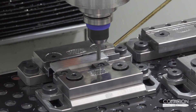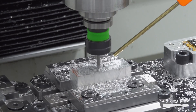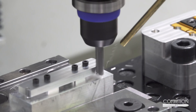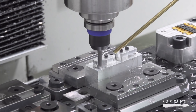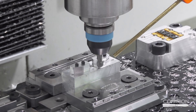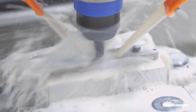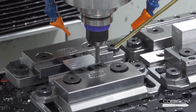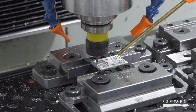I also made handle spacers and buttons again, pretty much the same way I did before: drill some holes, make a fixture — just keeping it simple and quick until I do water jet. This time I made sure to leave room for the lollipop end mill ahead of time. After a few in aluminum, I made some titanium ones too. The buttons were done with a similar technique.